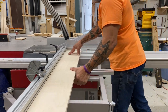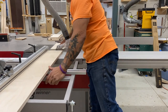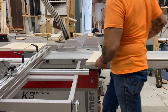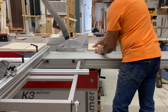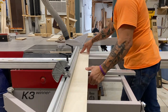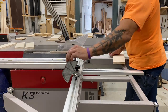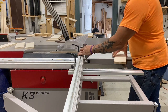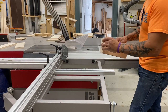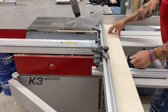The rip capacity on this particular K3 is about 78 inches with the crosscut fence in place, but the crosscut fence can be easily removed and you can rip much longer material. I routinely cut 4x8 sheets with this saw. Using the crosscut part of the saw and then moving the rip fence forward, I can make that same cut and all my pieces are exactly the same. Another way: using the crosscut part to cut all the pieces the same, then utilizing the scale on the crosscut fence — turn the piece around, boom — beautiful, just like that.